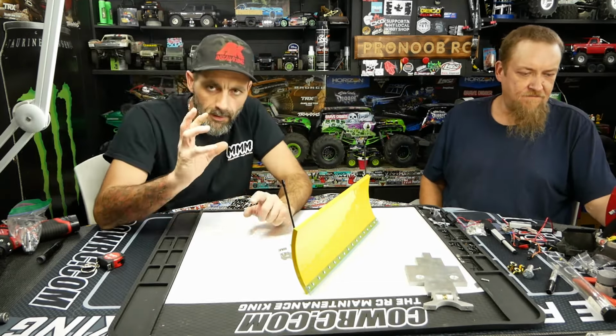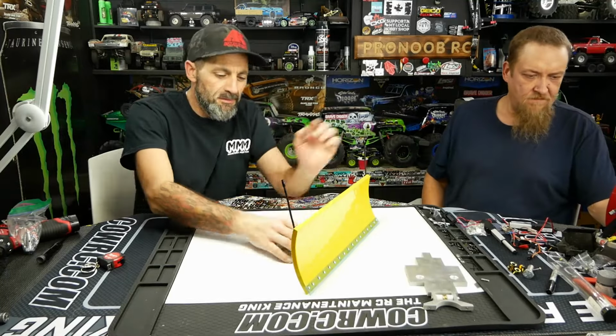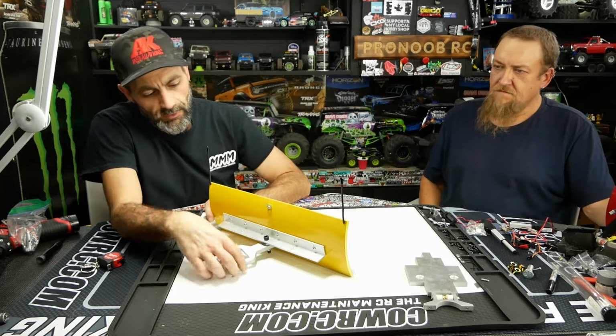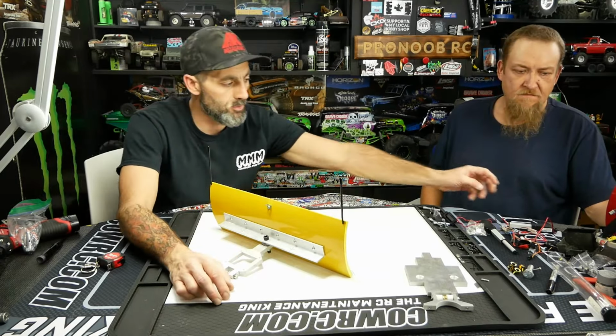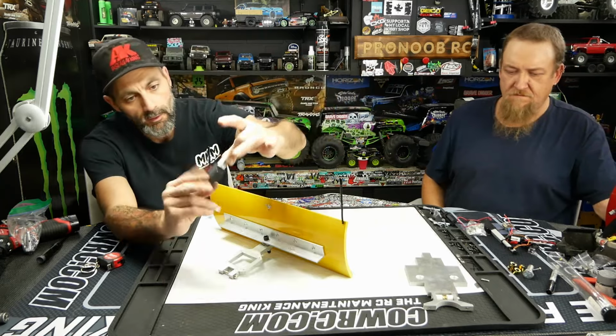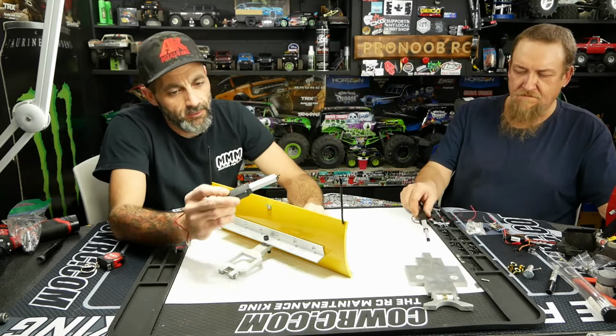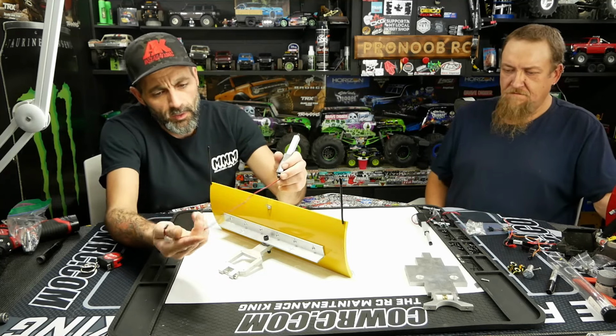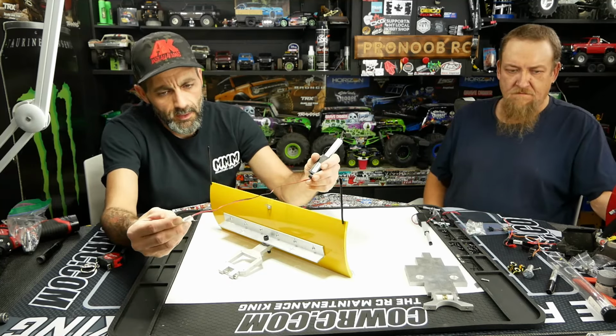It's already got the servo winch that we're using for the lifting. There is a little mount on the back right here. And what Jared and I need to figure out is how to mount the Firgelli actuators. These are L16 50 150 12S's. The 12S is 12 volt with the 2-wire.